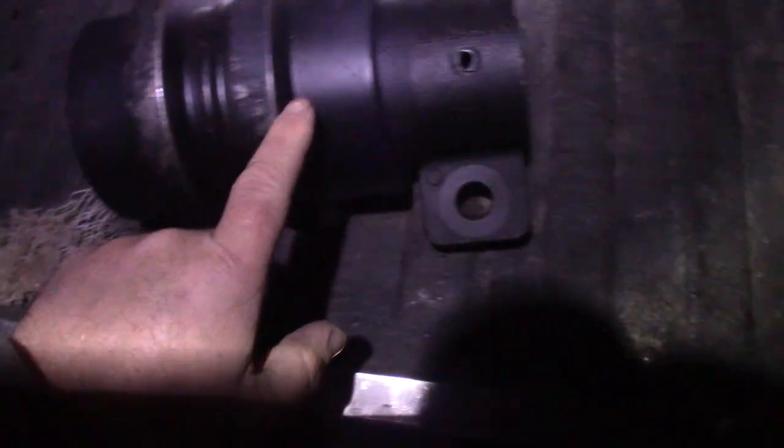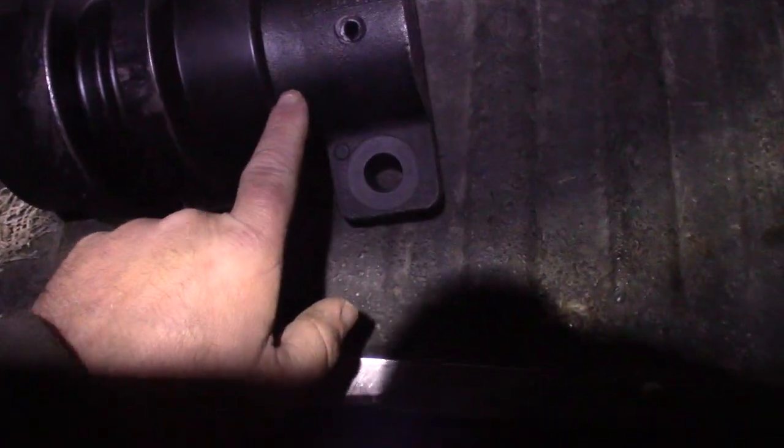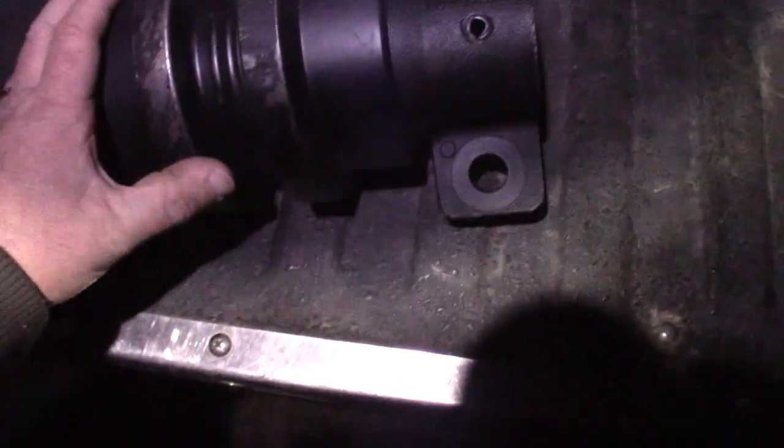And the replacement top roller came in. This is a replacement top roller for that very first one we converted to grease. I don't know why exactly, but the inside is worn right off of it, though the outside is okay. So I'm gonna get it out of there and send it with Dad. He's gonna chuck it in the lathe, mill it flat, sleeve it with some heavy water pipe, and then put it on the shelf, so I'll have it just as a spare. It wasn't too bad. The whole thing even shipped and delivered to my house, which they did in just a matter of days. It's under $200.